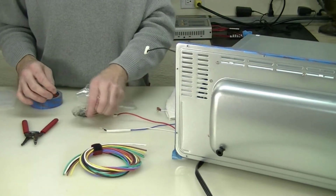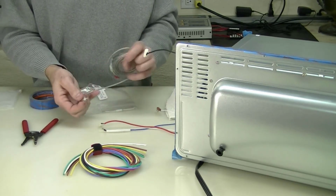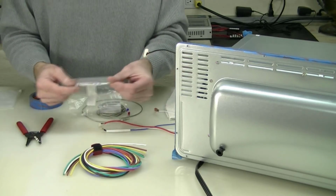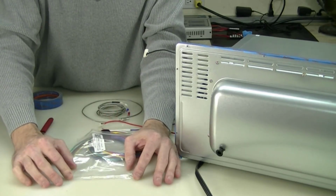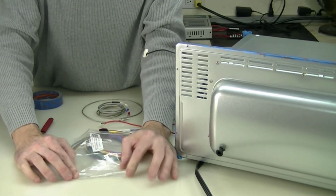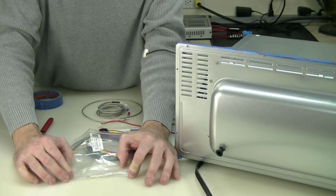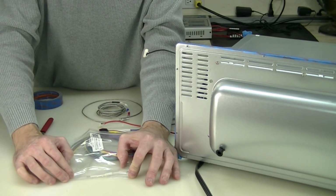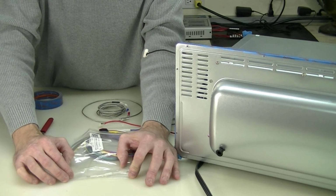Alright, high temp silicone wire. We've got the thermocouple temperature sensor. And as a last chance safety measure, we've got a single use thermal fuse that I'll rig up inside this thing. In case of a thermal runaway condition, it will blow and cut off power, and it's not a breaker, it's just a fuse. So when it blows, it's done and the unit is disconnected.